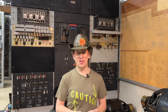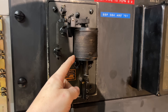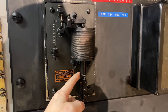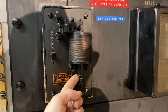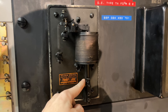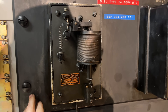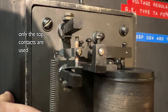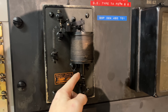Let's start by talking about the voltage regulation system. The regulator looks like this — we've got a solenoid here with its coil of wire and a plunger that moves up and down. As we put more current into this coil, the plunger moves upward, and with less current, the plunger moves down. Attached to this plunger is a hinged arm with contacts at the end: when the plunger moves up, the contacts open; down, and the contacts close.